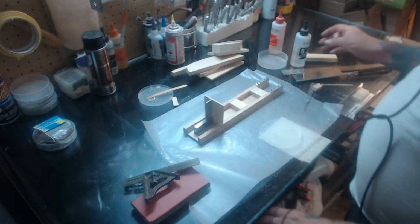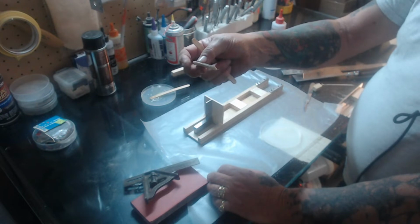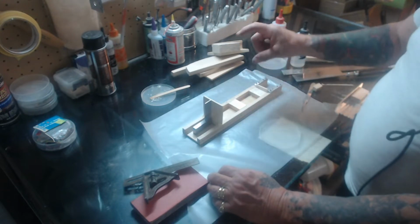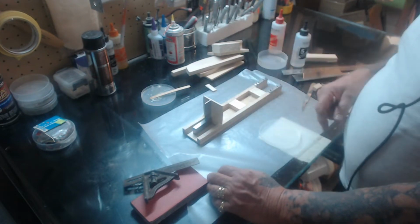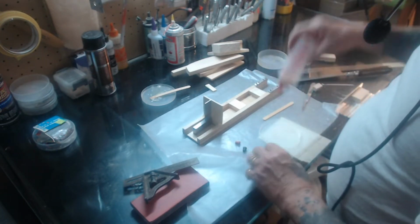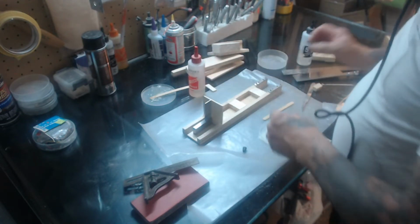So our crutch is just about complete. I'm going to put in F1 after it's in the fuselage so I can decide whether I want just the 3/8 wide by 8 to bridge the front motor mounts, or I want a 3/8 by 2" or whatever it is up to the cowl brake to keep the cowl straight, which I might do. But in order to do that, because this is not a kit, it's kind of a prototype, you have to do things kind of in succession. So it's a trial and error. Hopefully not too many errors.